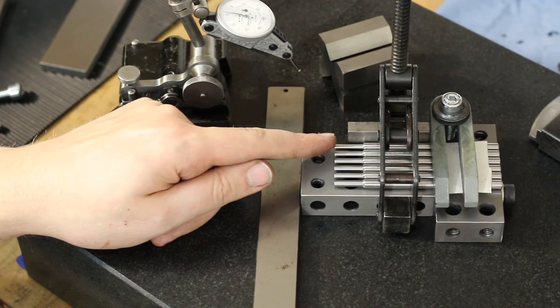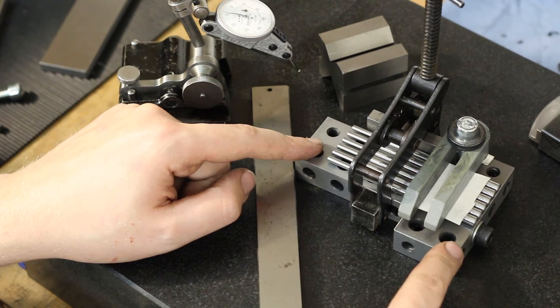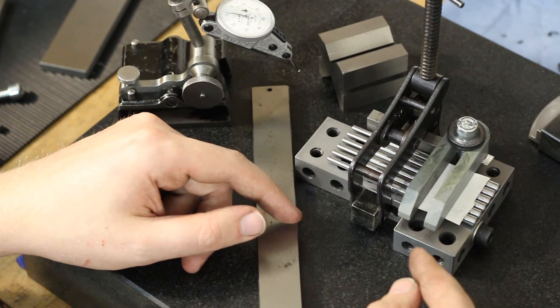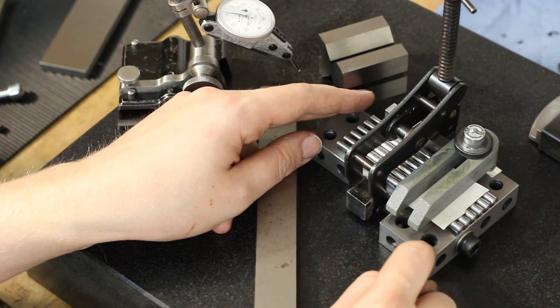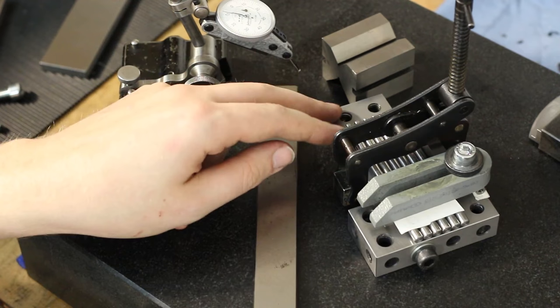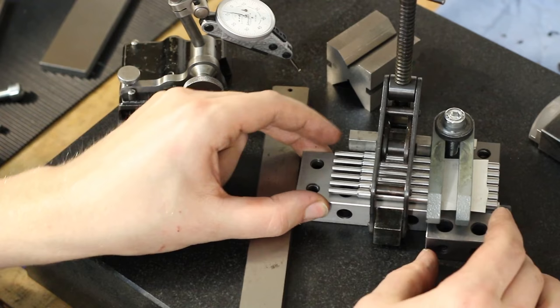Okay, I set up all six parts on this funky setup, I screwed together two 1-2-3 blocks. These are metric ones bought from Euro Trade. I'm very happy with them, especially as they are metric. They are 20, 40, 60, I think, and have M8 tapped holes and, very important, through holes for M8. So you can bolt them together instead of the usual Chinesium ones. I have no idea where they are made, but they are nicely made.